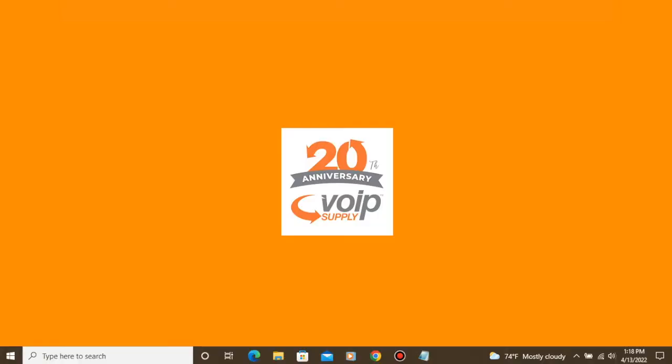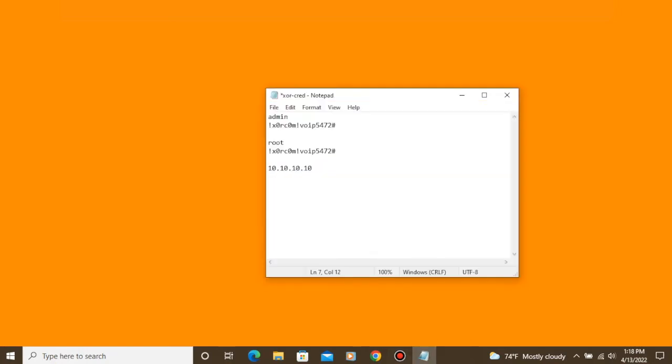Hi, this is Joe from the VoIP Supply Lab. Today I'm going to go ahead and show you how to access the Xorcom Swift CXW1000 web interface. Now currently I have just a local network and I have my Ethernet RJ45 coming from the Xorcom out into the NIC interface on my laptop. And out of box, the Xorcom comes with a default IP address of 10.10.10.10.